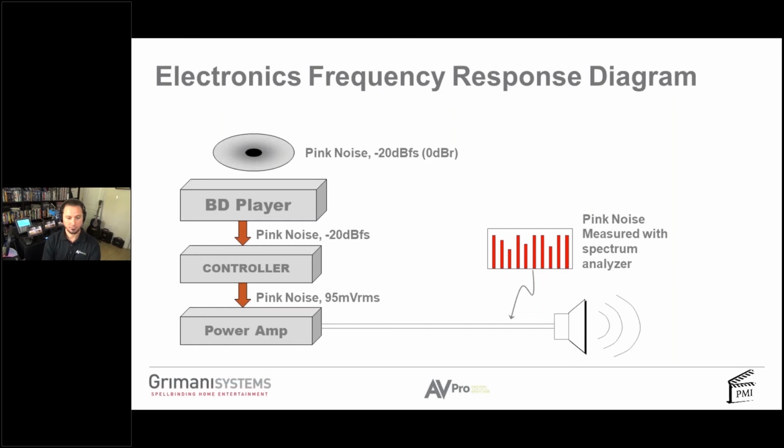Well, I'm getting very emotional about this. You want to play a disc that's playing audio black, the same thing as video black. And on the 5.1 audio toolkit, there's a whole section that for 2 minutes, I think, it's playing a Dolby Digital signal, but it's got no signal on it. It's just zero. And you need that to make sure the whole system is unmuted, and you're going to measure here. And you're looking to see if the power amplifier is oscillating.